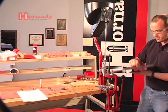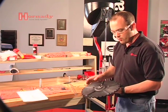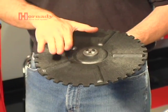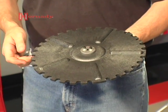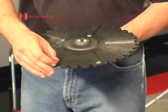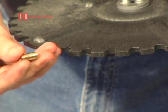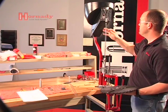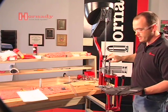The last piece we need to take a look at is the shell feeder plate. We've got four different shell feeder plates depending on the cartridge case that you're feeding: small pistol, large pistol, small rifle, and large rifle. These plates are designed to catch the cartridge cases in the hopper, orientate them base down, and feed them through the case feeder.